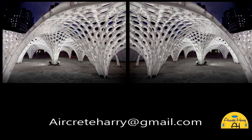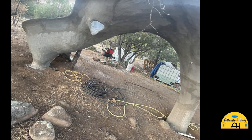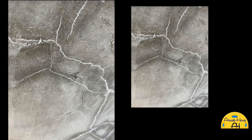Yeah, and really, even mortar at 4,000 psi is plenty strong. People have been doing ferro cement for a long time. It's plenty strong, but the benefit you get out of making it stronger is that it's a low water mix, so the particles come in closer to react, and you have that secondary pozzolanic reaction that seals the concrete and makes that reactive powder effect, which means the self-healing cracks will happen. And so that's important, and you get that extra durability with that higher strength mix, because it continues to get harder and harder over time.